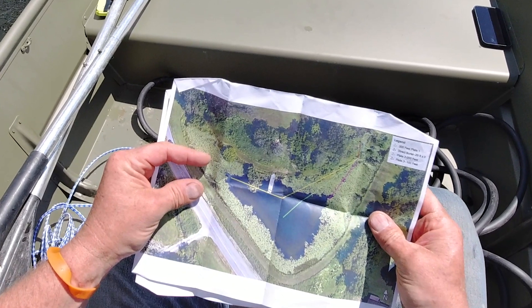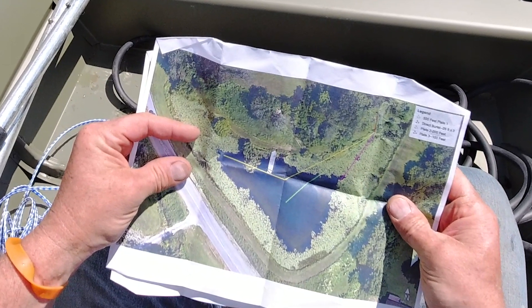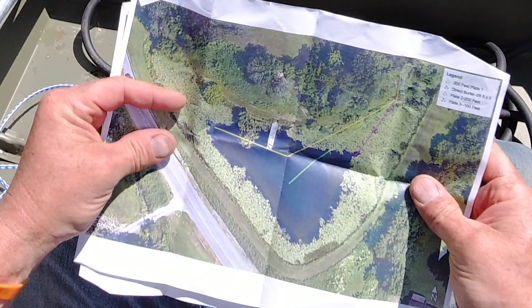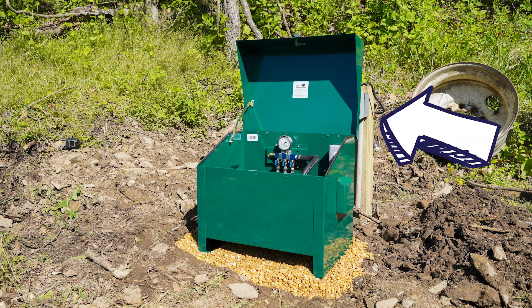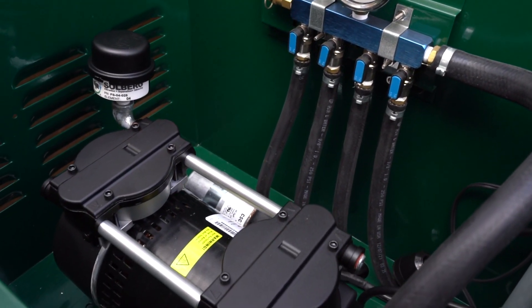Your aeration layout should be mapped by this point. If you do not know where to place the diffusers, contact Natural Waterscapes and we'd be happy to measure and calculate where everything should go in your specific pond or lake. At the compressor cabinet, plug the cord in at the back into your designated power source. Before taking your diffusers out into the water, be sure to check that all valves in the cabinet are open in the vertical position.